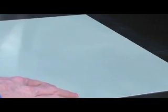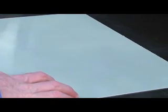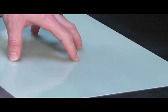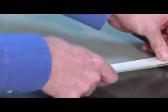So the first part is we're going to start with our base application of epoxy glass board. With this particular image, there's a lot of fine detail within the trees, the type, and the border that need to be held open. So that's what we're going to do. I'm going to tape that down to our base now. We need to leave some room open so that we can slide our spot make-ready underneath the epoxy glass board, so that's why I'm taping it like such.